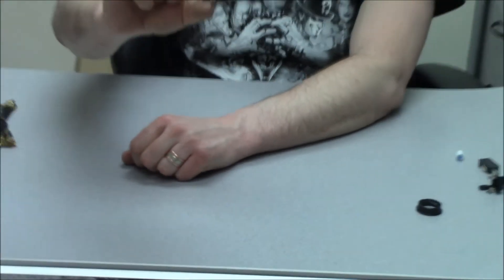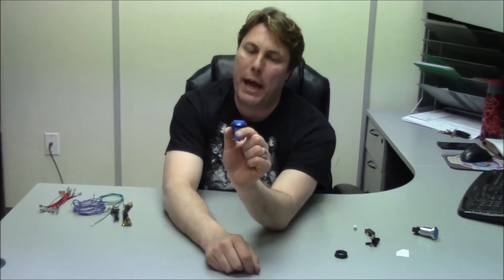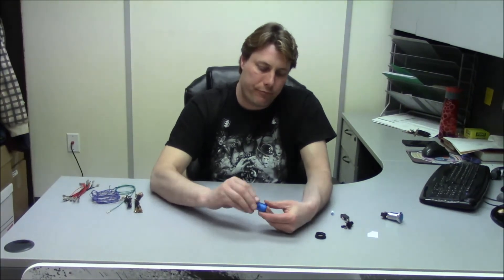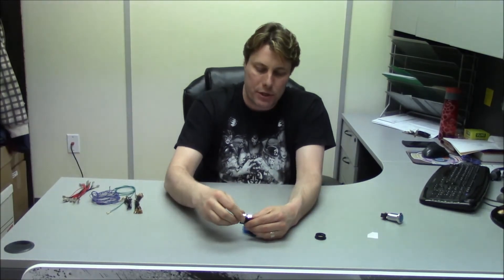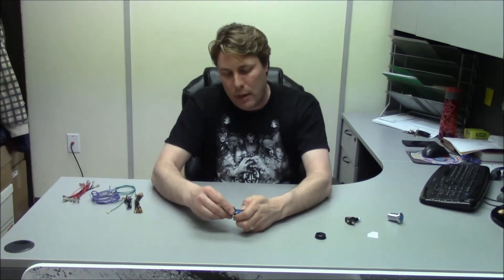I'm not going to do the insert part again for the other illuminated button, but I'll go through the assembly really fast. Take the spacer out — you don't want that sitting that high above your control panel for an arcade. Throw that away, take the nut out. Take your LED, pop it in, put the ground side on the mount side of your button. Pop the micro switch in, give it a twist — you heard the click. Happy days, the buttons are good to go.